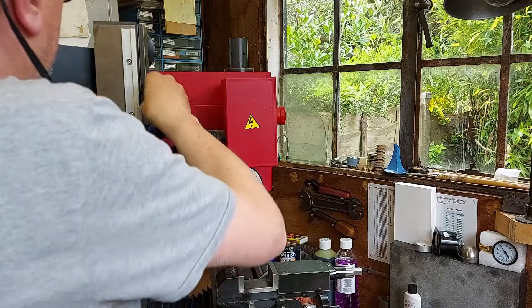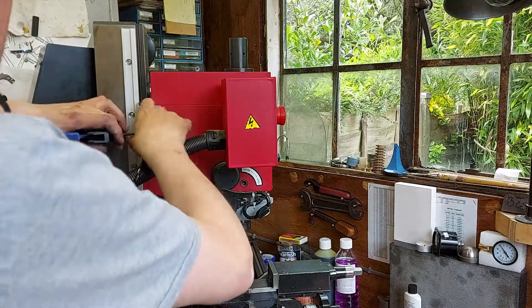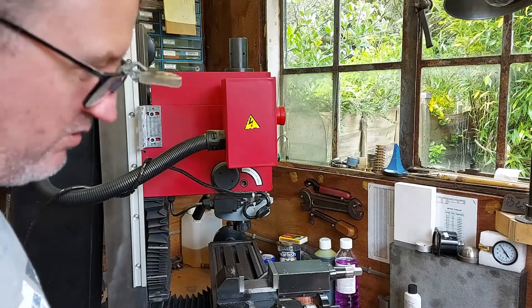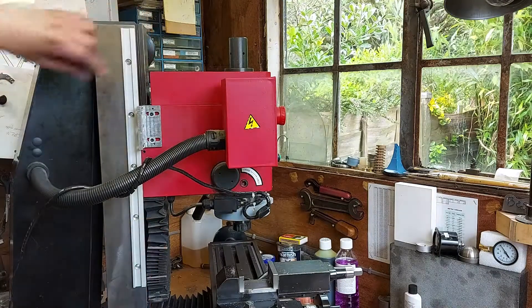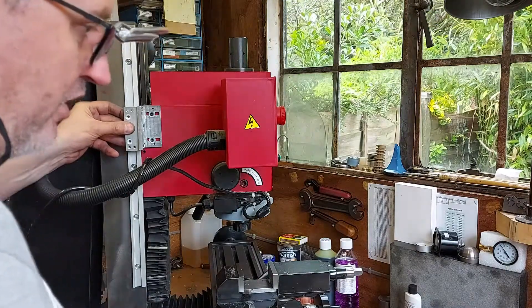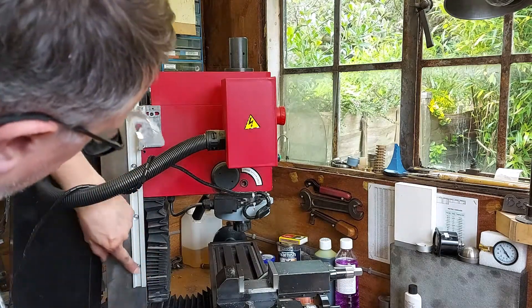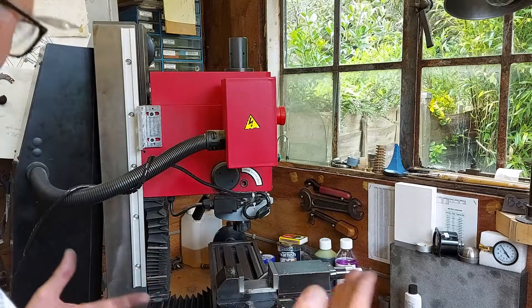That's good. I've got a bracket. I've got a good gap now — I'll just check that gap and tell you what it is between the bracket and the gauge. 1.6mm — so a sixteenth of an inch gap down there. That will be parallel because this is right onto this machined edge of the column. I'm going to mount the bracket on here which holds the sensor. That then allows me to line up and move this in and out. I'm going to put the magnetic strip in and seal all that off. But before I do any of that, because this is instrumentation and delicate stuff, I'm going to clean my hands.